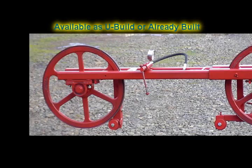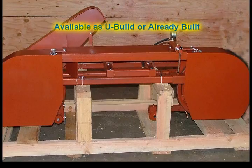The basic saw frame consists of the 2 band wheels, the main shafts and bearings, the blade tensioner, saw guides with their mounts, and the square tube saw frame. The super saw frame adds the 2 blade guards, the engine mount, the belt guard, and the rear cross tube for attaching the unit to the rest of the carriage that you provide.